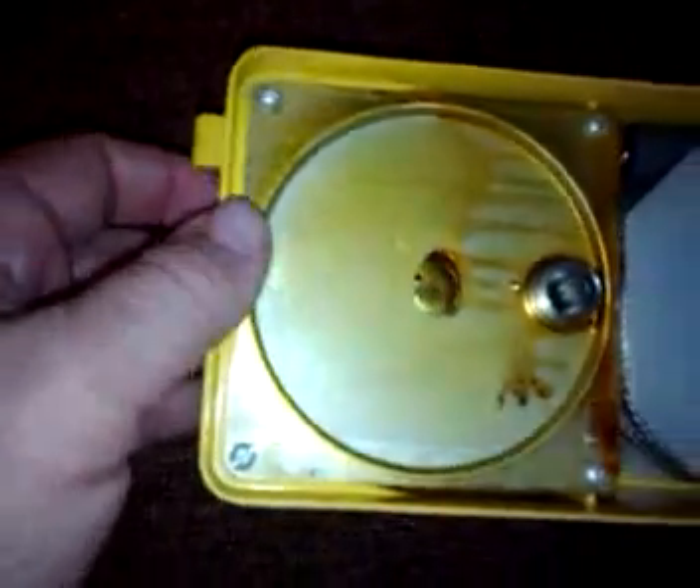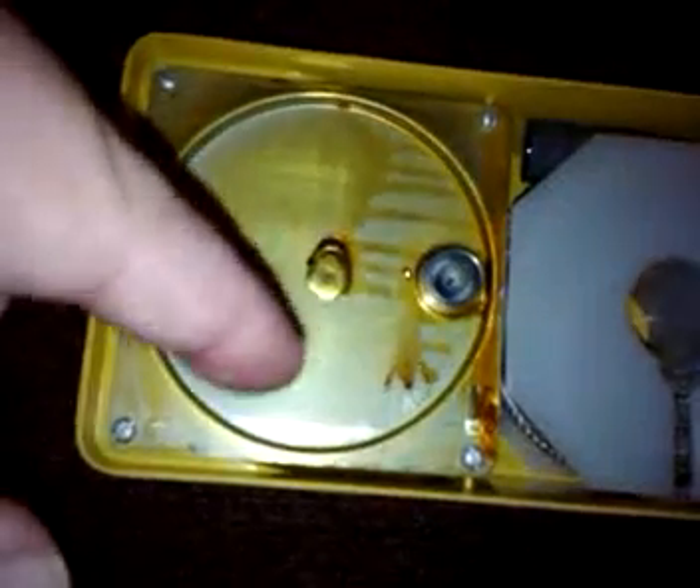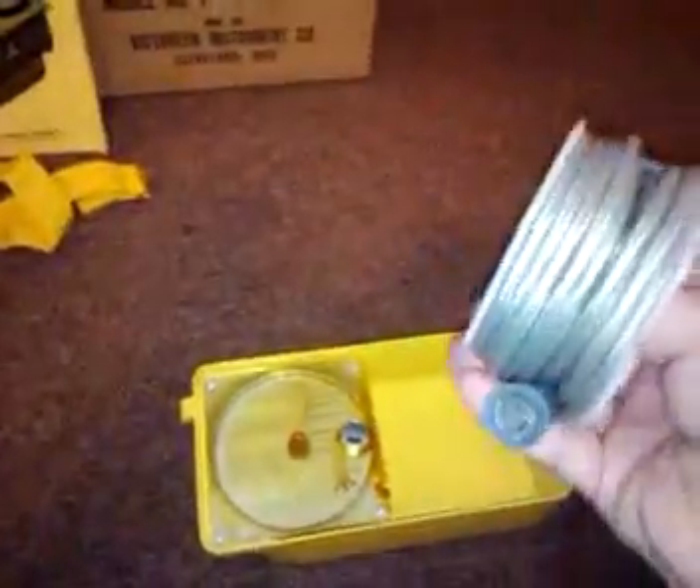This ionization chamber is hopefully sealed. The simple principle is: when a particle comes through and hits a molecule or an atom of gas in there and sends off a little bit of energy, the energy is picked up by the contacts and sent up to the gauge — that's how it works. This cord comes out and it's actually a triaxial cable, as it says in the instruction manual. In a fallout situation, you would connect one end of this to the ionization chamber and put it outside the shelter, then connect the other end to your meter, keeping the meter inside the shelter so you could read the radiation reading outside.